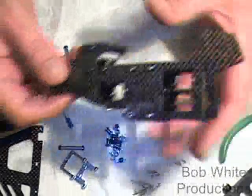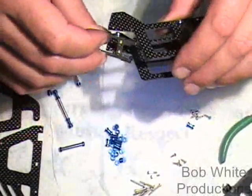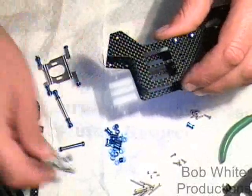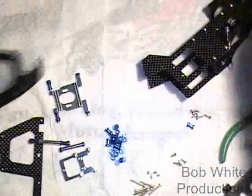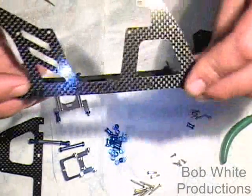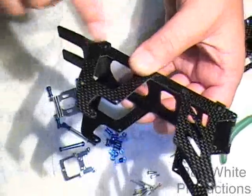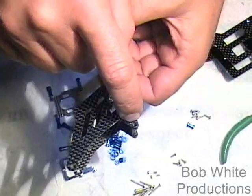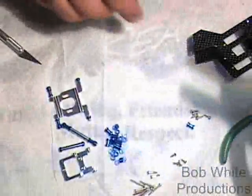We've got the upper frame built with no motor mount yet. Go ahead and mount the battery tray. If this is a straight SE build, this will be pre-built, but we're doing a rebuild. The motor mount and cross member aren't used until we join the upper and lower half of the frame. What we need to do next is build the lower unit with the bottom tray. Attach both frame halves — make sure you get the proper upper and lower — to the base plate. Note the orientation: the motor mount area is at the front of the heli, so make sure you don't get your frames backwards. Get your screws in. No need for the screw in the back because that holds the boom supports on. There are two screws — one here, one here on each side.